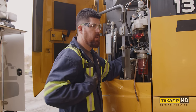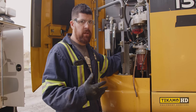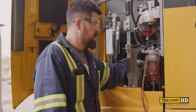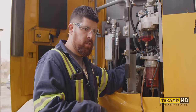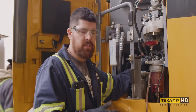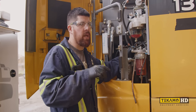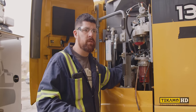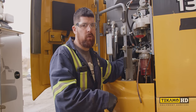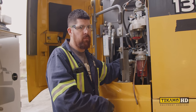We primed them up to save us sitting there forever and putting air on the tank. 99% of the time I don't pre-fill any filter — oil, fuel, hydraulic. The reason: that's dirty oil you're putting into that filter. The filter filters from the outside through the center. Any oil that went into the center is not filtered — it's going straight into your engine unfiltered. If you fill a fuel filter, plug the center port, fill from the outside in, and let it flow until the inside is full. Then you know that inside fuel is filtered.